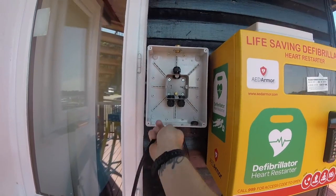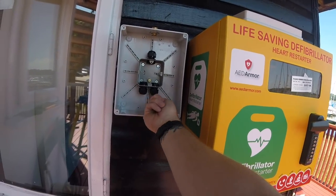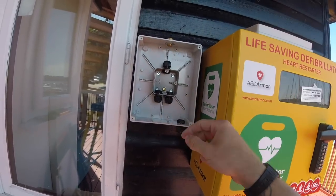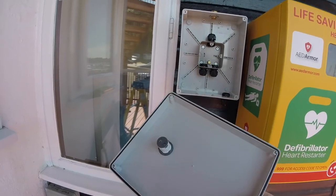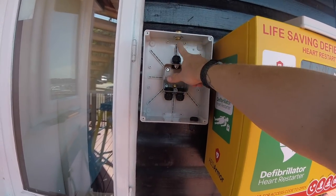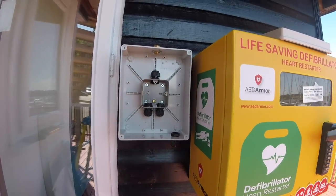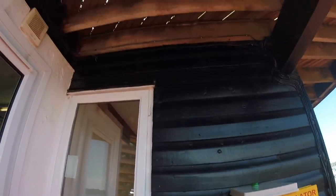Stuffing gland in the bottom for the defibrillator supply - that flexible cable will come through that stuffing gland and into the enclosure. The auxiliary cable goes out to the indicator light on the front. The inner core of the SWA is going to go straight into that stuffing gland and into the box where the connection will be made. Now about to run the SWA in and get it all clipped along, then just connect it at the fuse board and we're pretty much done.